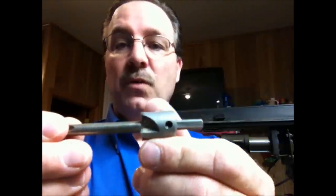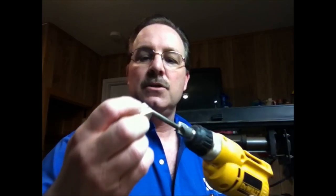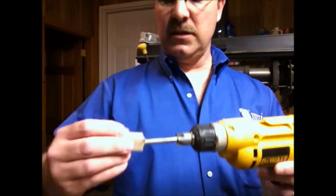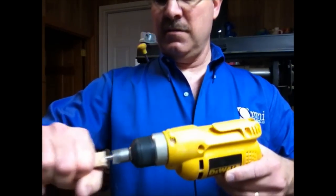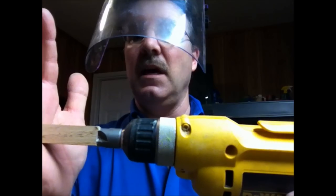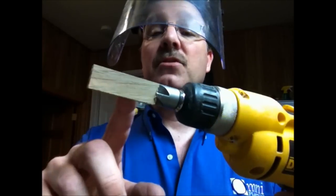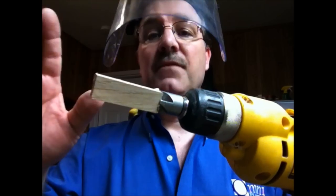Now I'm using the hand drill to trim the second blank, starting at the perpendicular-line end. Make sure to wear eye protection — I switched to a face shield because it was throwing out a lot of chips. Also, make sure your hand is not over the end of the tube, because there is a possibility the center part of the barrel trimmer could come through. Hold the blank up here. Use your best judgment and be as safe as possible in your shop.